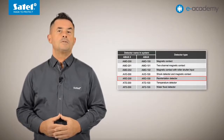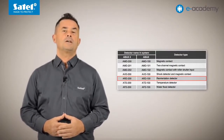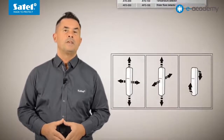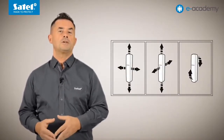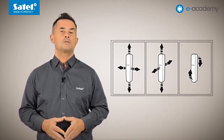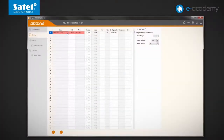The fifth mode available in the universal detector is the reorientation detector. It works in the ABAX2 system as the ARD200. Its task is to detect changes in the position of the object to which it is attached. The device remembers its position when being switched into the active state or when turning on the test mode, and then reports the detector displacement in relation to its initial position. The ARD200 occupies one position in the controller; the detector state will be signalled on the OUT3 output and the connected LED3 indicator. Violations of the AR2 input, to which the Bi-2 switch is connected, will activate the detector. For the reorientation detector, the detection sensitivity can be defined in a range from 1 to 16; the higher the number, the higher the sensitivity.